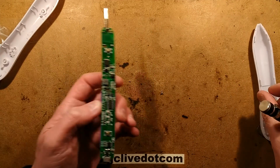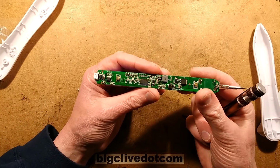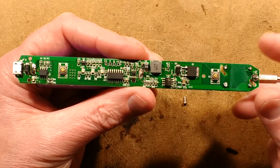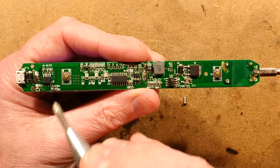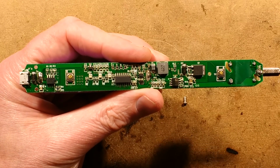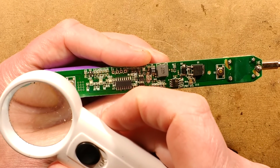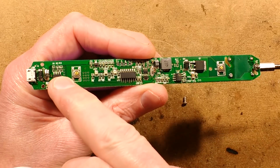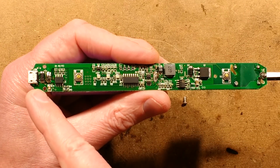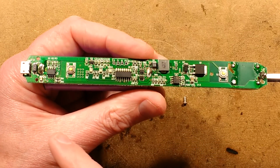Let's brighten this up now. Let's get the white things out of the way, and then I'll just brighten this up excessively, probably. Yeah, kind of excessively, that's all right. Let's zoom down and take a closer look. Button. This chip here is almost certainly going to be a sort of TP4056 type thing. 5056. Okay, so that's the current limiting. I see a diode here in the input as well, so that's for polarity protection, possibly maybe to start dropping the voltage. We've got the charge regulation chip, which limits the current.